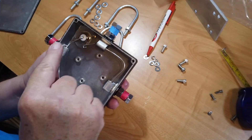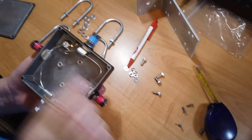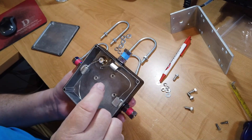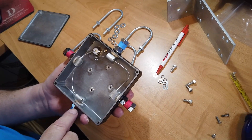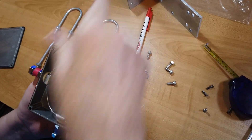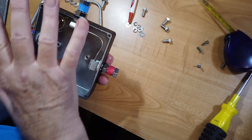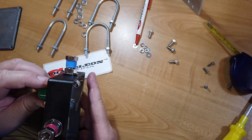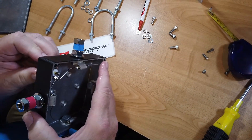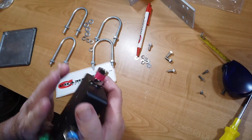Here is the center. The center goes to this and this. So these two hamsticks — both 20 meters — are fed each side. This goes from the outside of the SO-239 here. And here we have also the hot side and the other side, so they're fed centrally. Now notice that this is balanced inherently, but we have an unbalanced plug. They do not supply the ferrite beads to put over your coax, but you can just loop up some coax — about nine turns, nine inches in diameter — and that will be good enough.